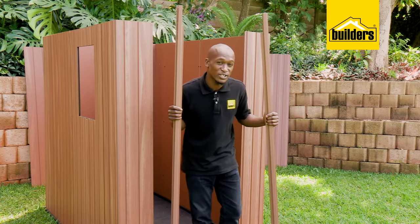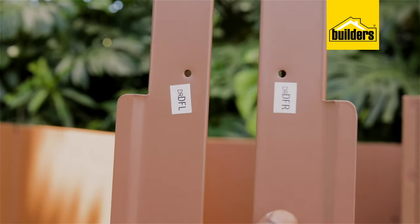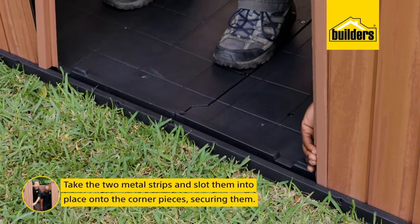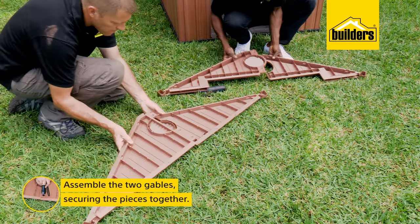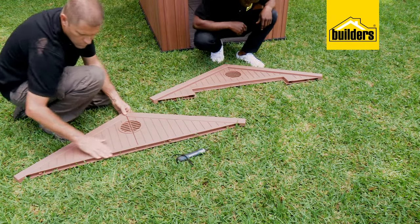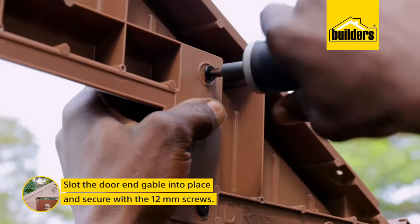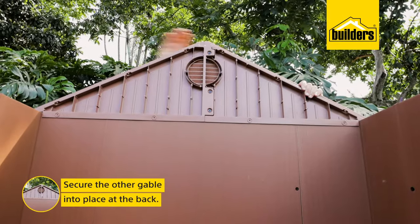And now to install the door frame. Take the two metal strips marked DRDFL and DRDFR, left and right, and put them in place by slotting them into the base and then onto the corner pieces and screw in place before assembling the two gables. Just make sure you use the gable with the door cutout on the door end. Slot it into place onto the two metal door frame pieces and secure with 12mm screws. The other gable goes on the other end.